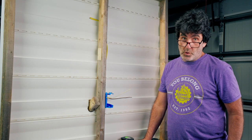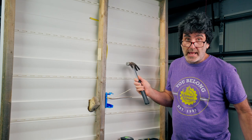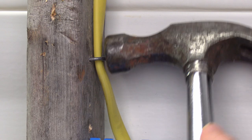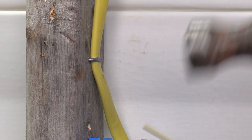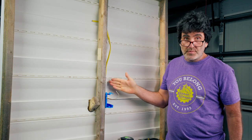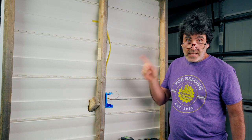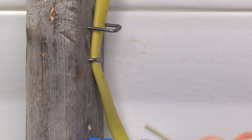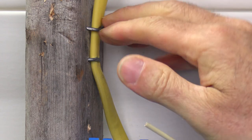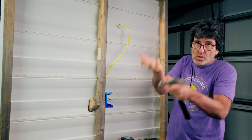Number five is a potentially dangerous situation. Don't staple the wires like Clark W. Griswold hanging up Christmas lights — if you don't know what that means, I'll refer you to Christmas Vacation. Over-stapling crimps the wire and will damage it possibly down the road, which could result in a short and a fire. Instead, the staple only needs to be tight enough so that it's just barely touching the wire. It doesn't need to grip the wire so hard that you can't pull it out.